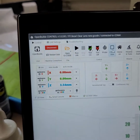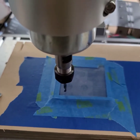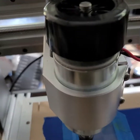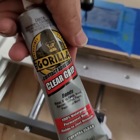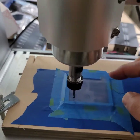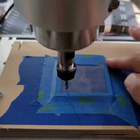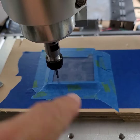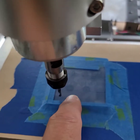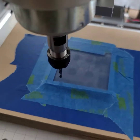What I did was it was important to take my material, which is affixed by placing my sacrifice board here, painter's tape on the back side of my piece of clear acrylic, and then I'm trying out this glue — Gorilla Clear Grip. It's supposed to be pretty fast-setting, and that is on the tape on my acrylic and between the tape on my sacrifice board. For some added stability I've added tape around the side, and since I'm cutting out a piece that won't be anchored down, that glue is going to be very important — hopefully it'll hold.